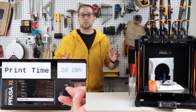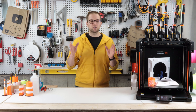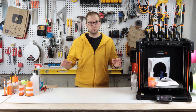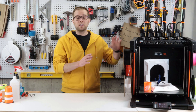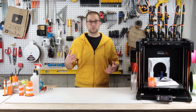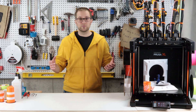I've spent a couple of weeks with my Prusa XL and I'm really pleased with it. I'll talk about some drawbacks first, though they're quite minor, then the things I love. A lot of folks online complained about initial XL versions - teething issues, stringing problems, and the printer being very loud. Prusa has done a good job addressing these: the printer now ships with a 0.4mm nozzle which seems to help with stringing, and a firmware update has improved the noise. My XL worked great after assembly and the only issues I had were my own making.